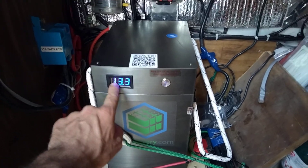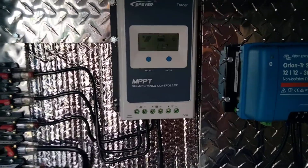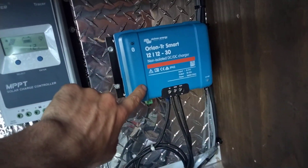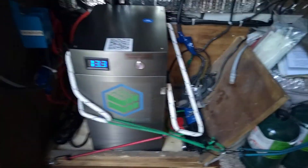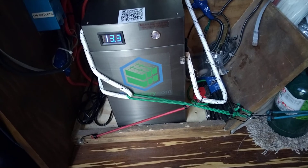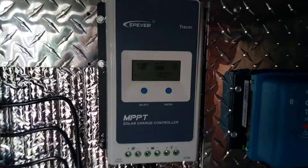I'm going to get a glass panel — no more flexible ones. With 24 volts coming in, since the lithium battery needs 14.6 volts to charge and I'm only putting out 14 volts from the panels, it's not going to fully charge the battery. But I have this programmed to put out 14.6 volts. The big batteries want 14.6 for the float, bulk, and absorption — and they don't need any equalization.